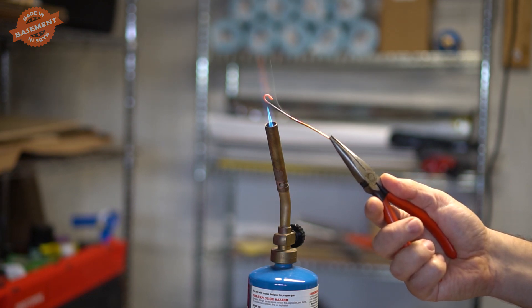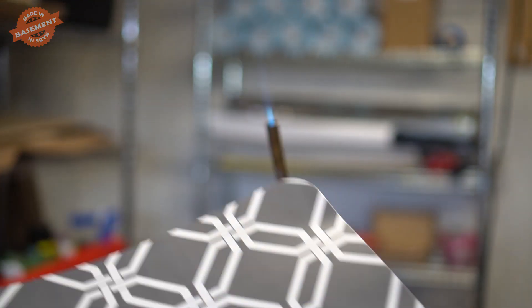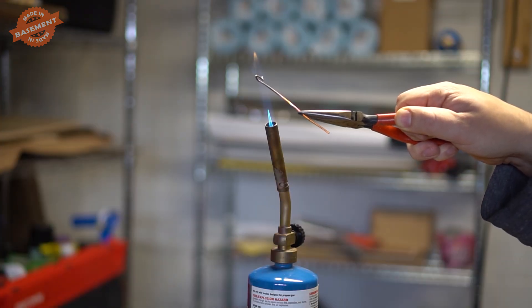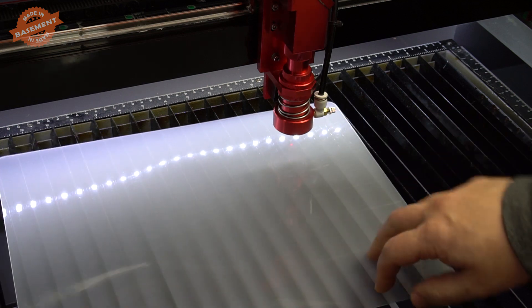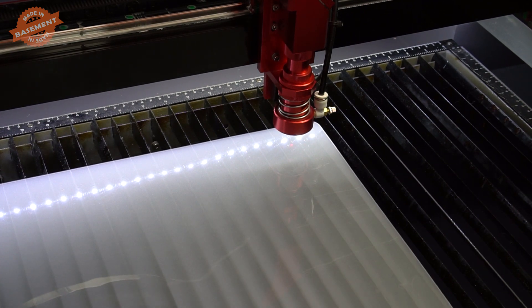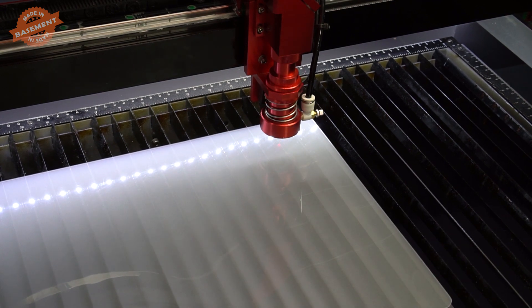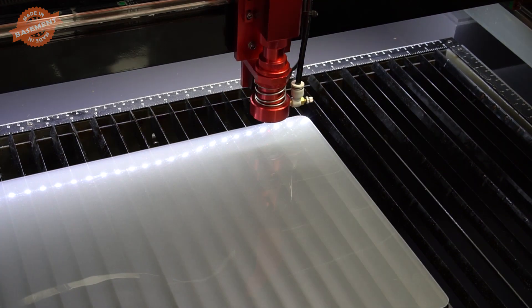Just yellow — so that looks promising. Now let's try the second one. I'm going to cut a small piece. I've never cut this material so let's see what settings it needs. I'm going to focus it first. I'm using a 2.5-inch lens and this is a 60-watt laser machine. Let's try 50% power and 50 millimeters per second speed.